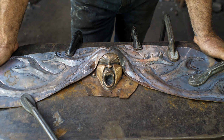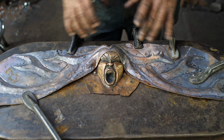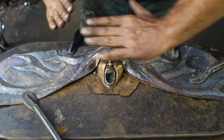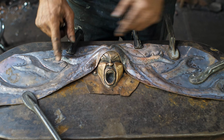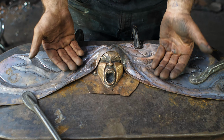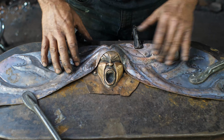So I believe that's pass number 3 now, and we basically defined it, and I'm trying to keep this simple and stylized, so I'm starting to get the shape in there. Just basically like a low ridge on all these pieces, and I think that's working. I don't think we need much more than that. We've got an overlap here, so I'm going to pull this, anneal it, and push forward a couple things and then back in place and redefine it.